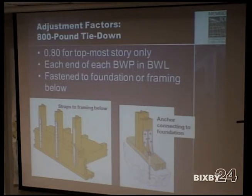It talks about the continuous load path and how you can build to resist either an F0, F1, F2, because you can build to resist up to 135 mile an hour winds. We've got details of how to do that, whether you're doing every rafter and then every other stud, or every stud, or floor to floor, and header to top, and header to studs. We've got all that information that I go over.